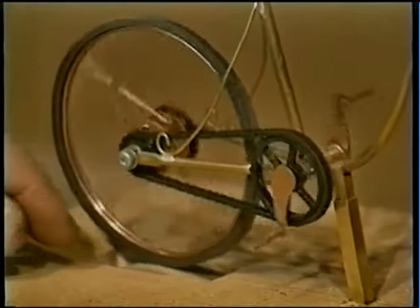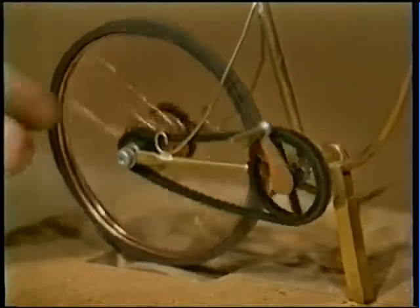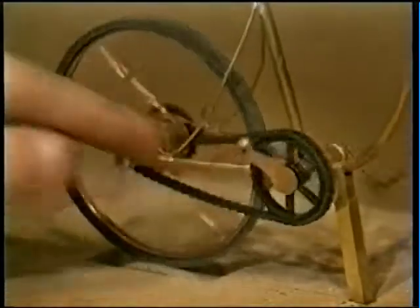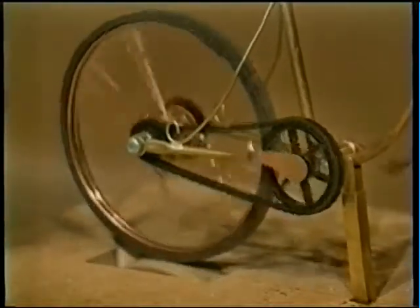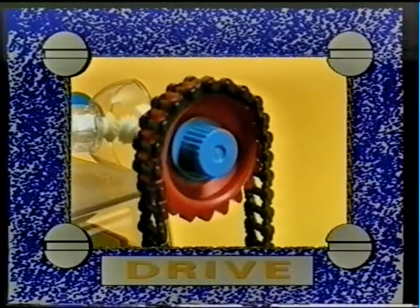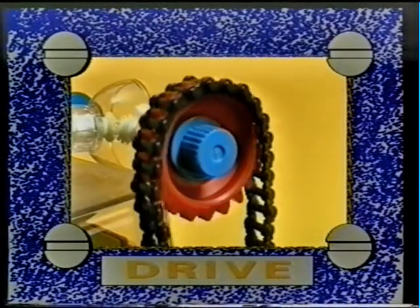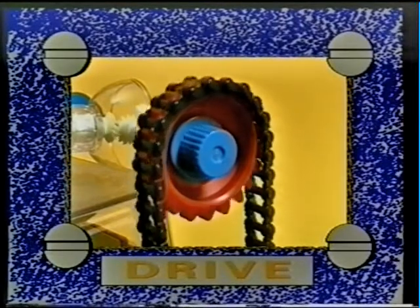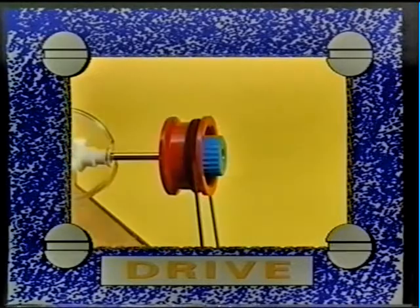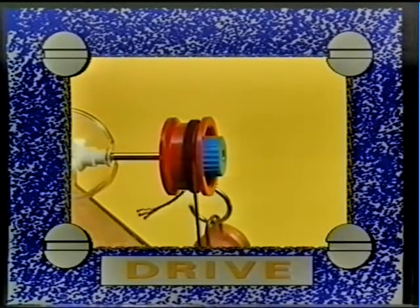On my bicycle, the road's moving. This drives the back wheel, which then drives the chain, which then drives the pedals. This is the opposite of what would happen on a wheeled bicycle. Drives can be split into two main types: friction and positive. This is a positive drive because the chain is kept locked to the sprocket wheel by its teeth. This is a friction drive because it relies on the friction between the string and the pulley wheel.